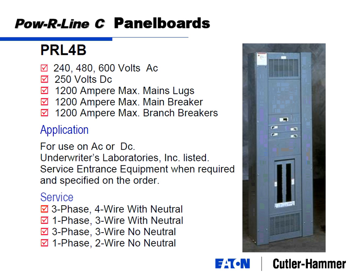1200 amps. Now that's a good number to remember, because the difference between panel boards and switchboards, which we'll come into here in a sec, the largest panel board is 1200 amps. And 1200 amps is the standard cutoff when you consider switchboard or panel board. 1200 amps is a good cutoff. And anything higher than 1200 amps, you got no choice.